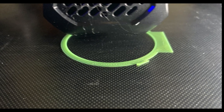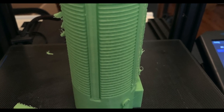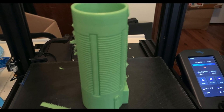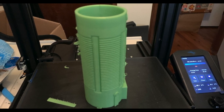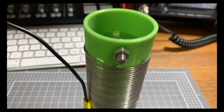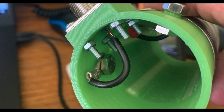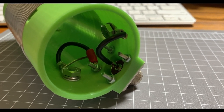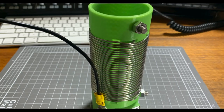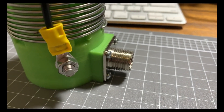There you can see the top element — linear loaded, coming back down the other side. Now I did experiment with 3D printing an 80 metre element. The problem I found is that the gaps needed to be a little bit larger — probably about 5 millimetres gaps between each of the coil elements. Once I put the antenna wire on, which is literally aluminium fence wire, connected it up with a few automotive connectors with a bit of solder on the centre point, that connects to a loose wire that will eventually connect up to an alligator clip. I'm going to reduce the number of turns so I can actually get an alligator clip in — that's one of the downsides, you can't get an alligator clip into that tight space.